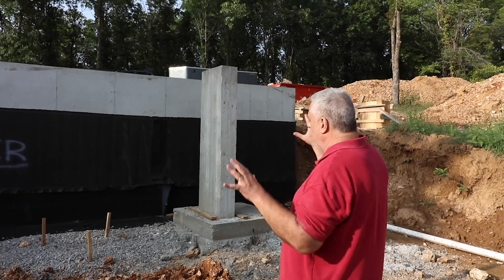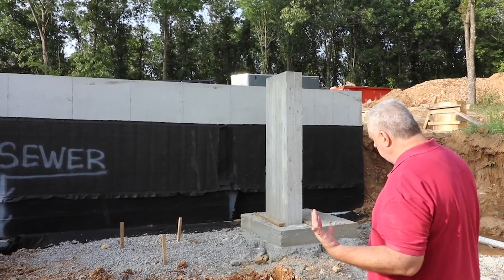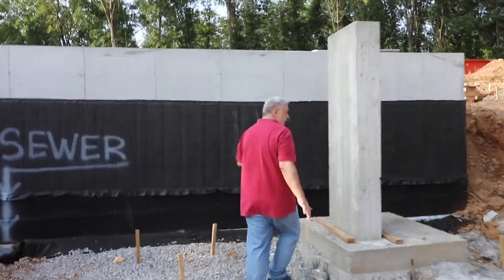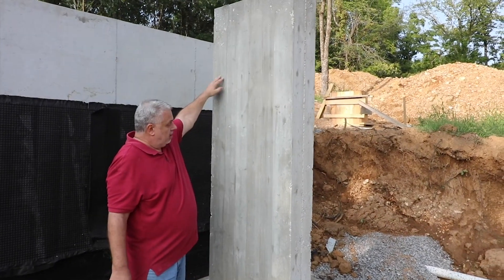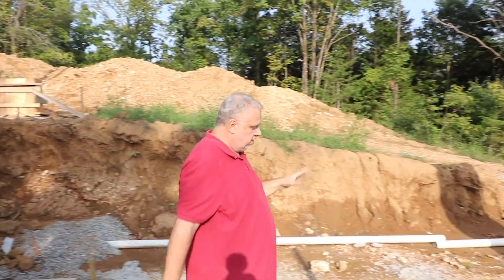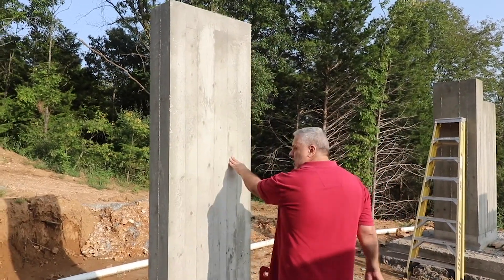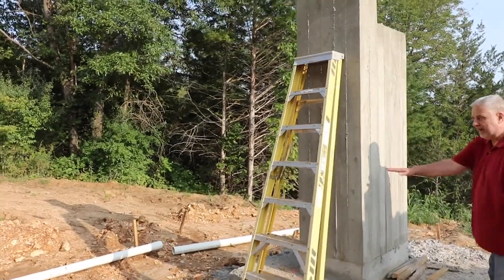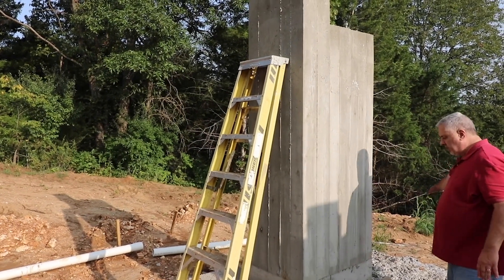Getting back to the piers — you can see our foundation wall there and our drainage system being placed. This is all going to get backfilled. The thing to understand is we're actually standing below grade right now. When we start backfilling, the ground is going to come up in here, so most of this is going to be below grade. This is going to slope down so that when we get to this pier, which is about 15 feet away, we're going to be at mid-pier, and by the time we get to this behemoth of a concrete pier, we'll be down in here somewhere — climbing down, breaking grade, and then catching up to the grade beyond.